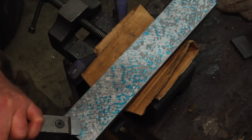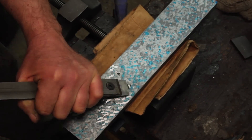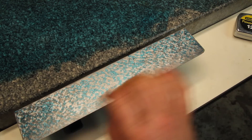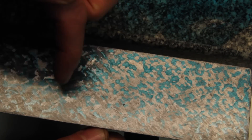Now I'm gonna switch to the hand scraper and hit individual points. I did a couple of rounds of hand scraping and I'm pretty happy with how it's progressing. But now we get into really reading the tea leaves. Some of the spots over in this area have more of a dark margin around a light center, whereas over in here they're a more uniform color. What that means is these are a little bit higher than these. So now I'm gonna go through and hit those high spots and sort of leave the lower points of contact in place.